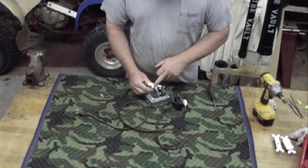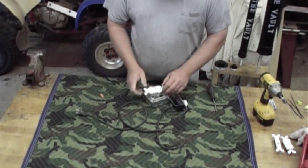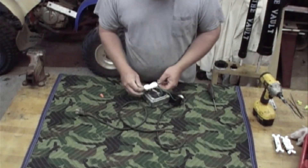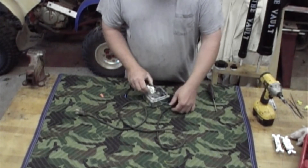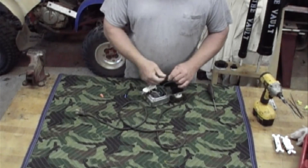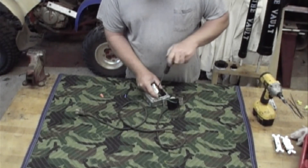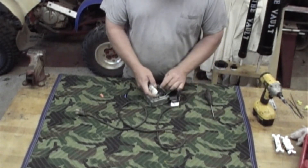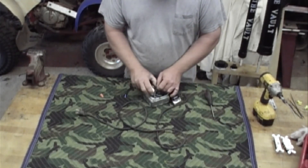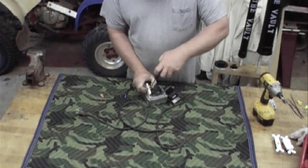Your silver side gets your white wire. Ground is on green. Black is always on brass. I'm going to take one of my wires from my dimmer switch and loosen my other screw on my brass side, because you've got to have your hot going into your dimmer switch. Fold it over and run your screw back down on it.